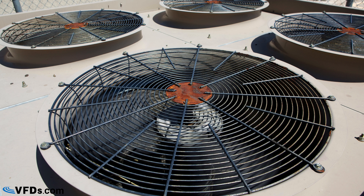This fan is a variable torque device. With a variable torque device, I could go in and just spin the fan with my hand. But as the fan goes faster and faster, it loads up higher and higher. So the speed causes the torque to change — the torque changes with speed — and we call that a variable torque load.